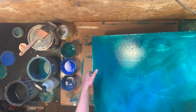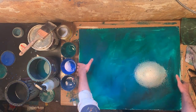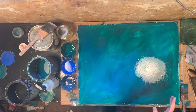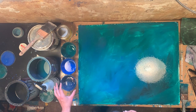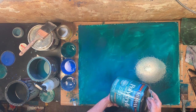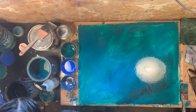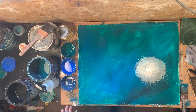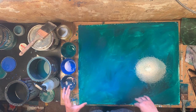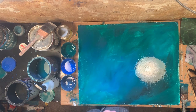So in this case, we're using water to make this fluid, but I have been asked in the past to paint marble on a vertical surface. And if that happens, what I would recommend is to take some of your paint and suspend it in some sealer. Here I have some polyacrylic clear semi-gloss sealer. If I was painting this vertical, I would want to use that sort of as my water, and it would thin out and there'll be less pigment, so it'll be more likely to flow in this similar way.